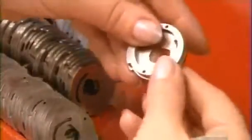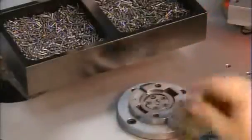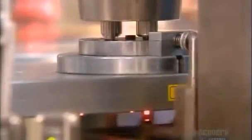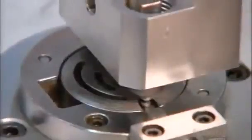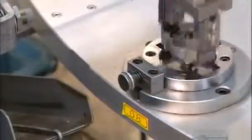They begin with the pumping mechanism, sandwiching a gear and several rollers between two metal plates. The rollers will rotate to pull fuel into the pump and then push it out. They test each roller assembly by spinning it from the bottom. A robot then pops it out and moves it to the next station.